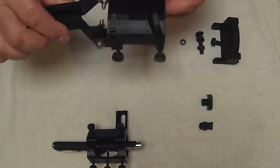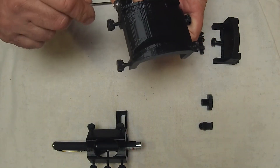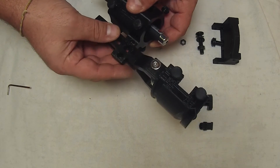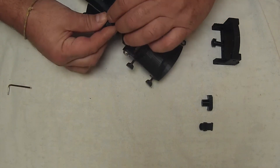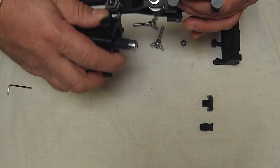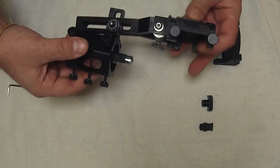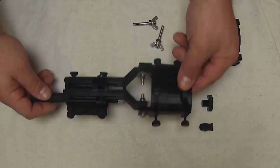So we have the device assembled here — about two-thirds of it. Tighten it up. For this portion of it, I like to use nylon nuts so it'll stay at the tension you want. This one is an 8mm by 30mm or 35mm. This one I like to just leave hand tight so I can adjust it at will. This is kind of the primary single screw that I adjust to get the basic location for the laser pointer, and then I use the knurled screws front and back to align the laser right down the center. And you just point that at the pole star as close as you can get it.